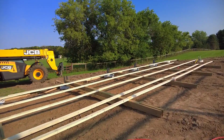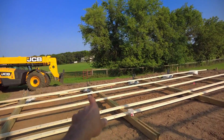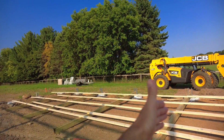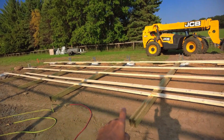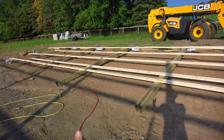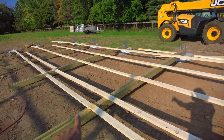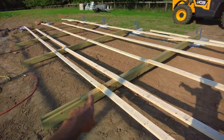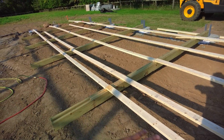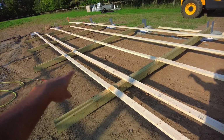last time. One thing I'll mention that I didn't yet, on the post spacing, as we're getting these spaced out correctly, the bracket spacings are within a 1/4 inch of where they need to be. What we're really concerning ourselves with is the spacing up here where the trusses are going to land, because we want those to be exactly uniform all the way down, because on our building, this style, we're doing drop purlins instead of nail-on purlins. So the pieces that go across the walls, these are the girts, and then if we were to do this on the trusses up top, we would do the same thing with just a regular purlin, where we just lay the board on top of the trusses and nail it down all the way across where it spans multiple, as we have here.